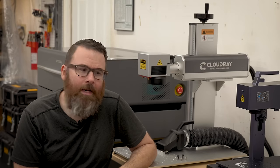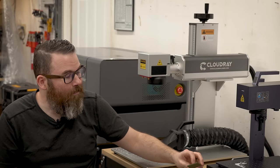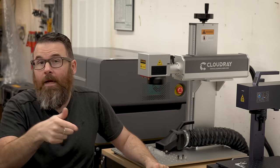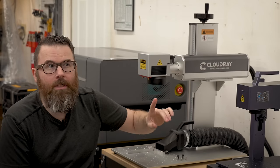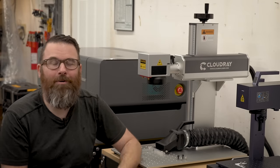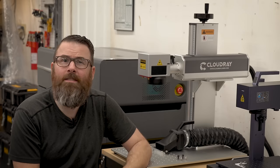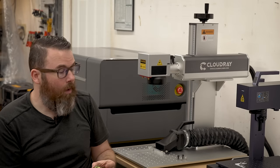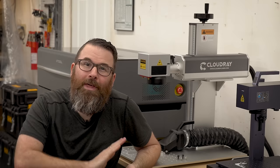This is definitely a process that I'm going to be using in the future. I really like the idea of using a fiber laser to mark and put text on things. For anyone wondering, this is a Cloudray QS50 — a 50 watt fiber laser. I have a link down below for a video review. I also have a GWIC G2, which is a 20 watt laser — they have the same fiber source, just different power settings. The Cloudray is a nicer laser, but if you have a lower power laser like the GWIC, or one of those galvo head diode lasers, that might actually work. You're just going to have to play around with it a little bit, print off some swatches, try different settings, and just see what works for you. Hopefully this gives you a better idea of what results you can achieve with a fiber laser on 3D printed parts. Thanks for watching — see you in the next video.